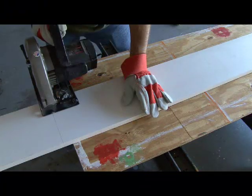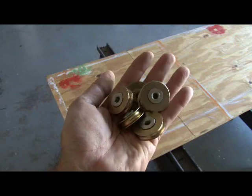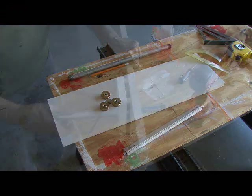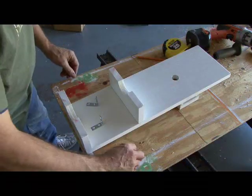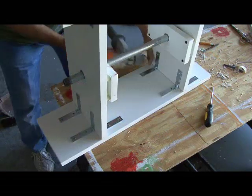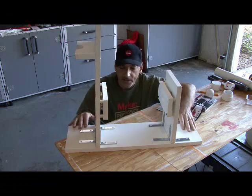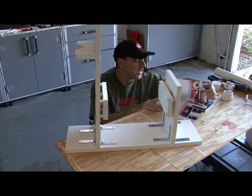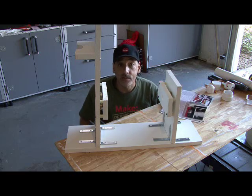You can download the PDF for step-by-step instructions. I cut out the main support pieces from PVC trim board. The crank bearings are patio door roller bearings and they're installed in front and rear bearing supports. A one-half inch galvanized pipe will be our crankshaft. The two-inch PVC cylinder is held in place by two saddles that are mounted to the front support and fastened to the base using corner brackets.